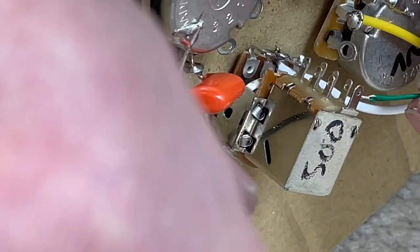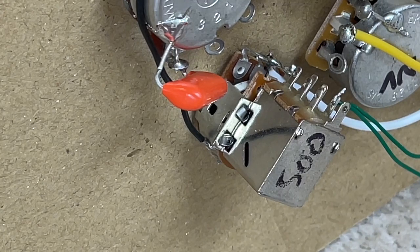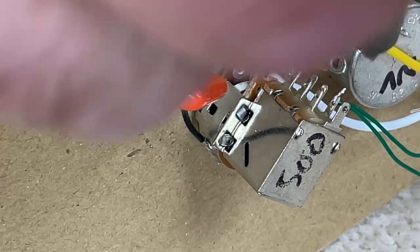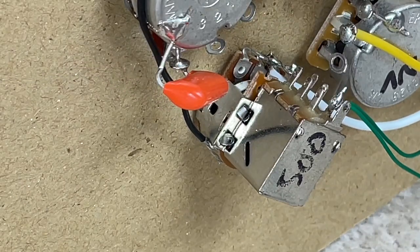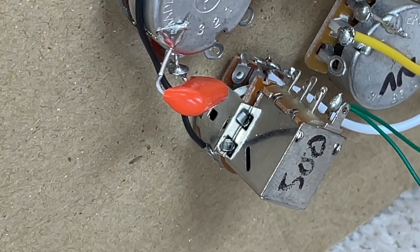Now we know it goes top side here, and that will hopefully go all the way through, but it doesn't want to stay there because it wants to just fall out thanks to gravity. So, oops, there goes gravity. So we can either bend it across like this, sorry, losing camera view, I'm sure. Right, so something like that, yeah. It's not the best view because you're still slightly obstructed. So now I go down to here and I try to put a blob of solder on there. And having done that, I then take off any extra. So there is our two greens going in the right place.